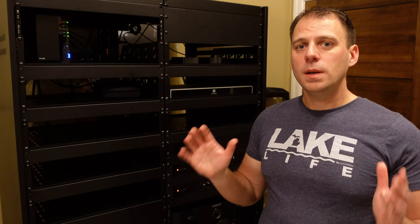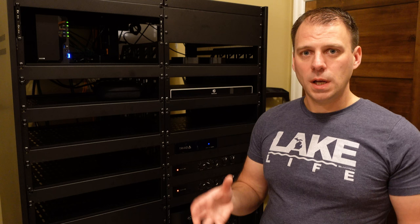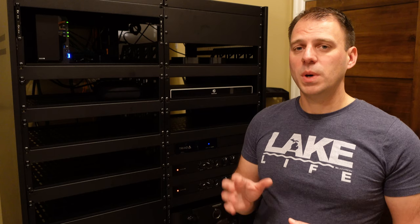In this type of setup, I could leave everything to auto-sense, meaning if I turn the preamplifier on for a given zone and an audio signal is present, those amplifiers will sense that and turn on automatically. Sounds nice, but honestly, I really don't like it for two reasons.